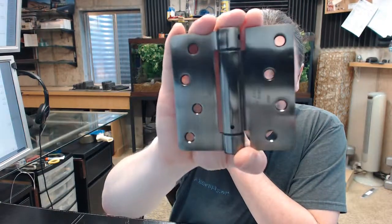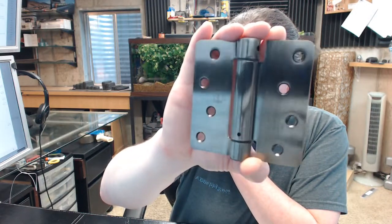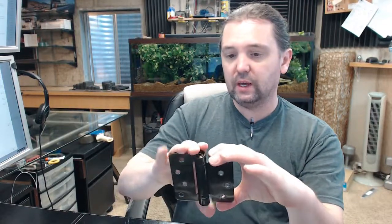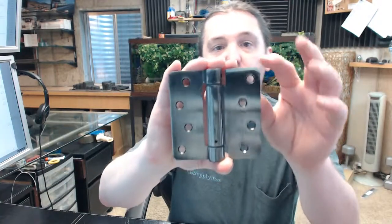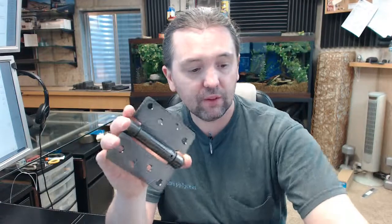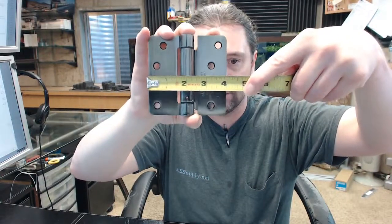You can see the lacquer that's on there, which is typical for US 5. The 1751 is a very specific part number for Hager — it means a spring hinge, but it also means other things. It conspires to mean that the corners are quarter inch radius, and that the specific staggered zigzag hole pattern is also inherently inferred in the 1751 part number. This is a 4x4 hinge, meaning 4 inch tall and 4 inch wide.